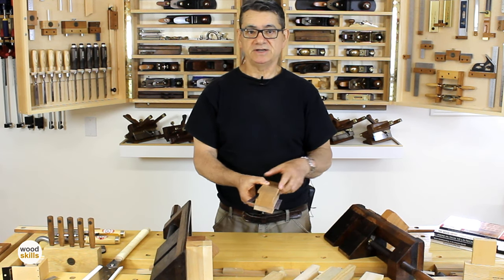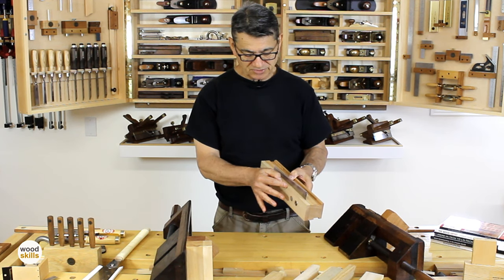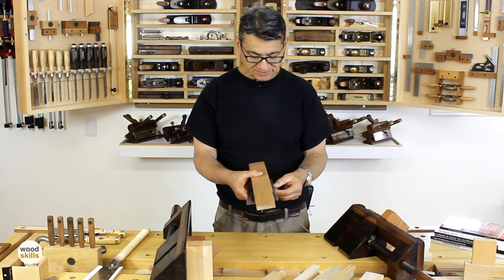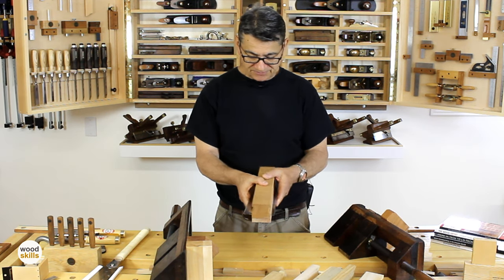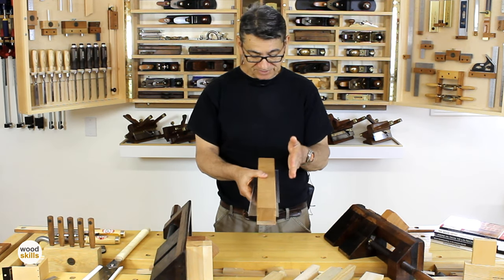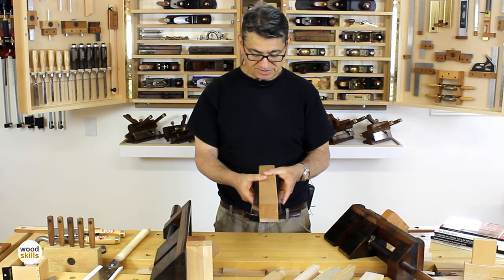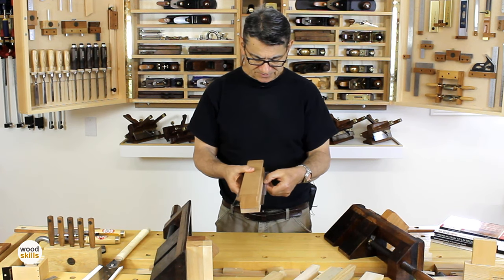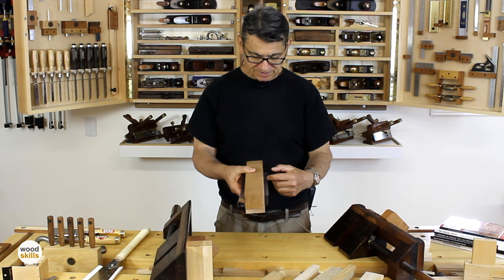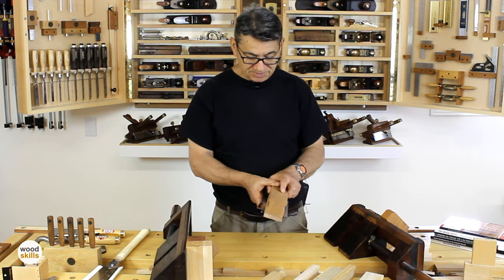It's a miter jack saw. And it's offset from the work surface, in this case 7/16. It could go as low as a quarter inch, but I prefer 7/16. I've got the blades covered now for safety, but it works with a Ryoba blade, and I can pivot the blade across. So I have rip teeth on one side and crosscut teeth on the other. The rip teeth are graduated, so they're a little more dense at the heel, and then at the toe it's a little more aggressive spacing. So that works well, and I'll be demonstrating all this.